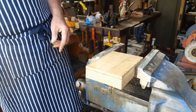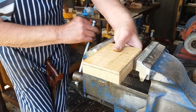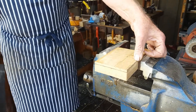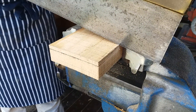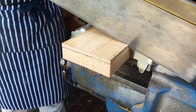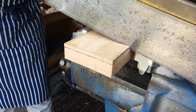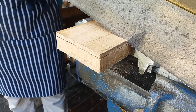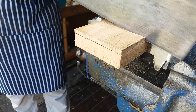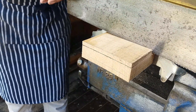I'm doing it in this vice because my bench is a bit low — it gives me backache and I can see better here. Thumb on the line to guide the saw, nice and gentle, let it go in, then take your thumb out of the way. Just follow the saw cut against the line — that's what I'm doing, keeping my eye on that.